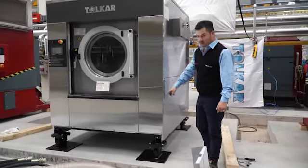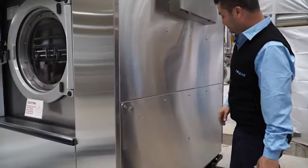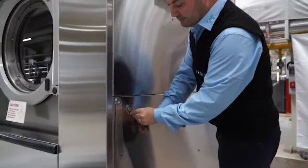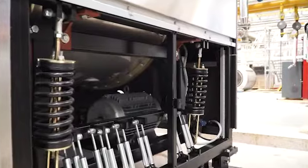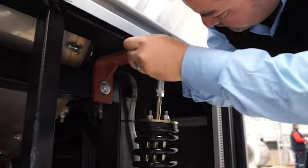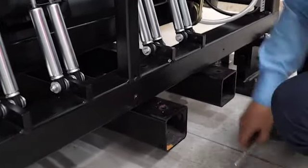When all ground connections are complete, need to remove the right and left side cover, because we have a transport safety connection inside of the cover on the right and left side. We are using a 13mm metric wrench to remove this cover. Inside this area there are transport pins. For connection to the bellow assembly, we are using this point for connection.